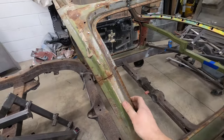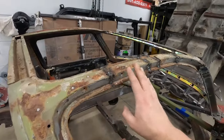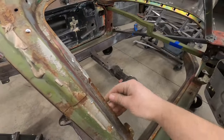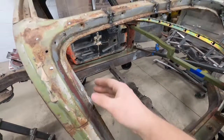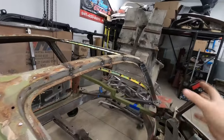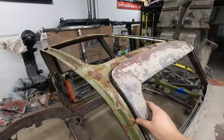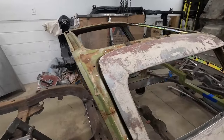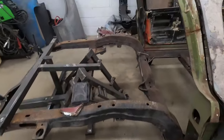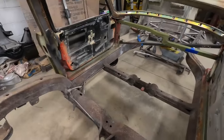This is where I'm going to leave the video off right now because I'll have to eat lunch and edit this so you guys can watch it tonight. I just need to come back through here, clean all this metal out, make everything real nice, treat the rust, fix any little damage in here, and I also have a little bit of welding to do on the underside. I have to prep that, get the drip rails to fit, and get this to blend in a little better. But overall everything is lining up real nice. In the next video I'll pull the cage off this birdcage table.